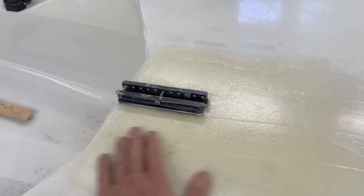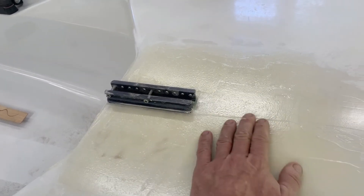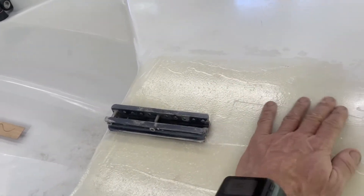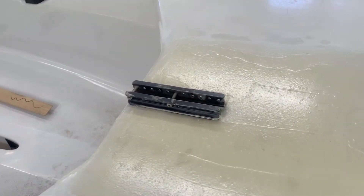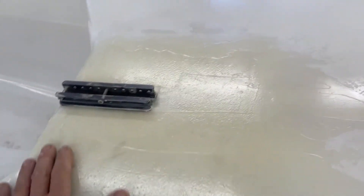At the base of the mast here, I did one layer of epoxy with fiberglass tape — three pieces — and now I've gone over that with West System epoxy with the 406 silica. So that's a structural epoxy.